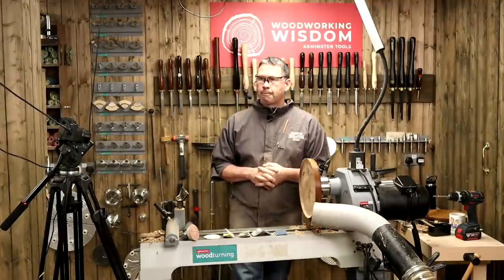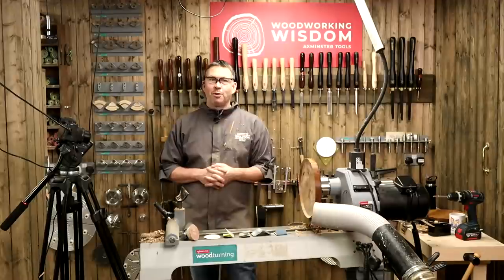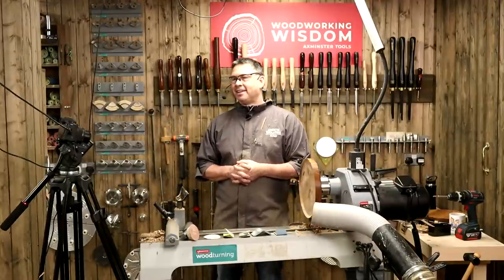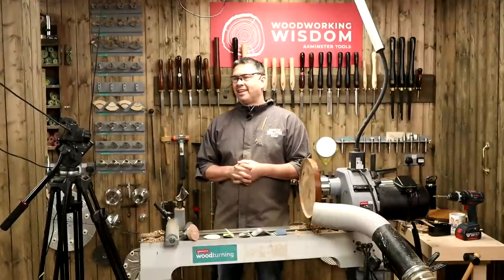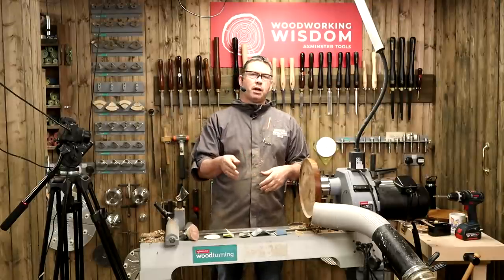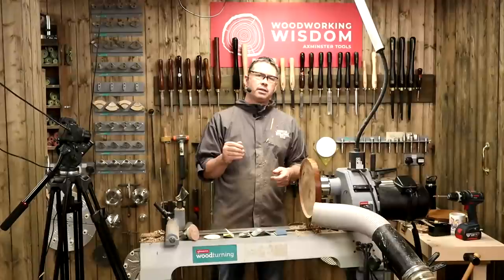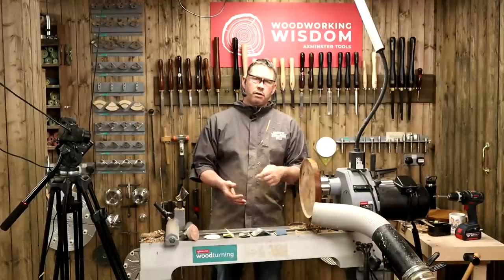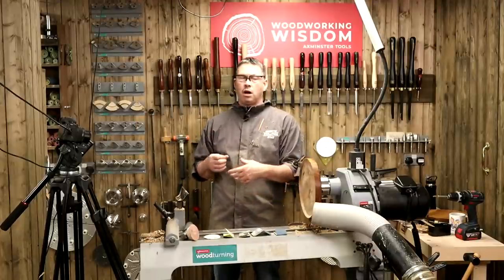It looks like there's lots of trees down at the moment. Oh, no, why? There's a couple of comments here. Matthew has just received a ton of magnolia tree wood. Again, a finish for that. Yeah, magnolia is fantastic. The trouble with magnolia is you're going to really struggle with it drying. It does tend to open up fairly quickly because it's quite dense. Beautiful color inside. You've got that lovely creamy and then the brown in the heart.